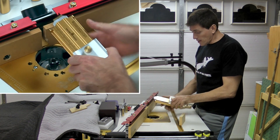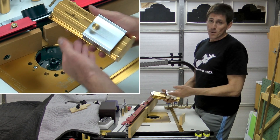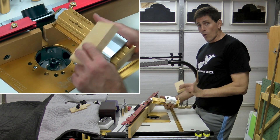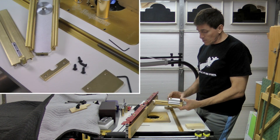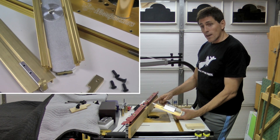Like most tools, it's got a little tiny graduated ruler on the side that'll pretty much get you in the ballpark to get an idea of what's in there, but you're not going to want to set that as your thickness. The whole goal of this is to actually use the stock in order to do the setting. Really what it is — it's a set of gears in here that as you move this carriage, half the motion is projected out to the front.